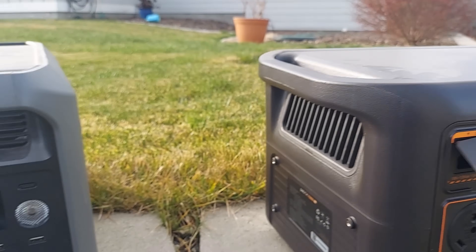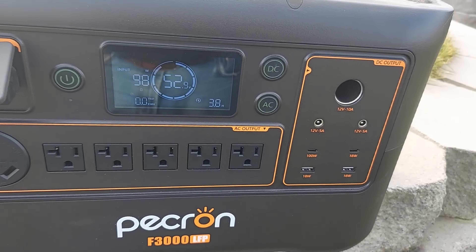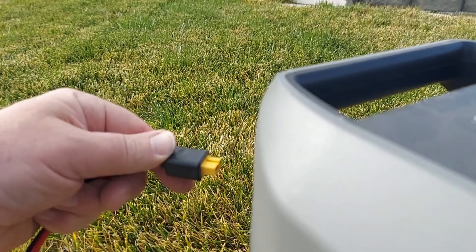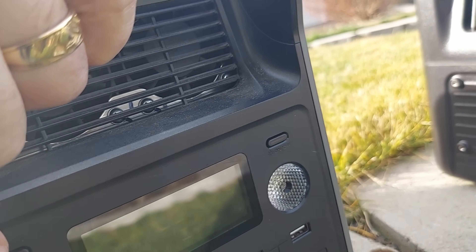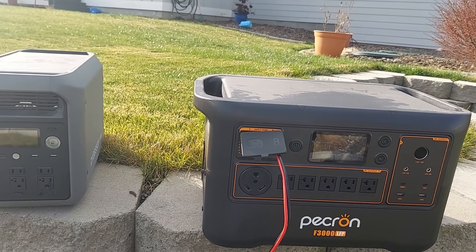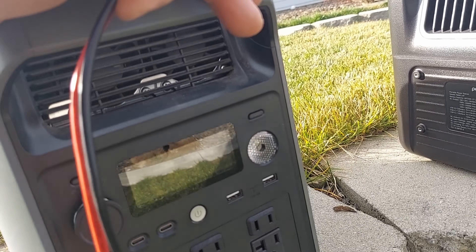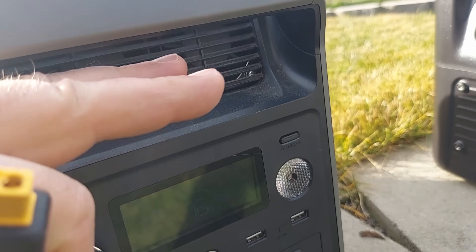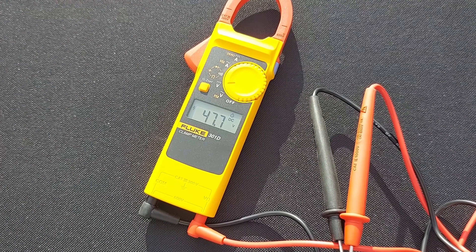There's 31 over here, we got 98. So if I unplug this, let's see what happens — there's 98, 113 total there. I'll put this back in over here: 125 here. 214 on this one. This one is currently showing zero. So I did see it split the two, but for whatever reason right now it's not working very well. I'm not going to say this is the best way to go. 250 watts coming in there. Now with this sunlight on the disconnected side, I'm getting almost 48 volts.